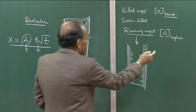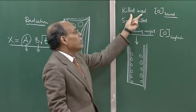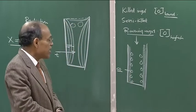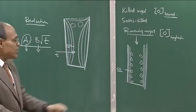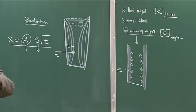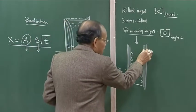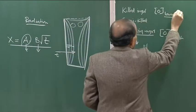In the ingot casting process: if you have the lowest oxygen, you have essentially large aluminum content, and these steels also have large inclusions. On the other hand, if the bubbles you generate are carbon monoxide bubbles, you want them to generate once a skin has formed — because when you roll the ingot, these bubbles are going to be collapsed. These are soft steels. However, if bubbles are close to the surface, they will undergo oxidation, creating problems — because in rolling, oxides and metals do not weld together, originating defects. Deep-seated bubbles are an essential requirement.